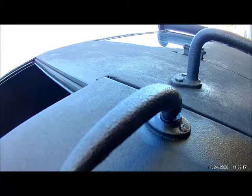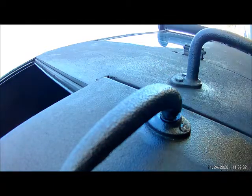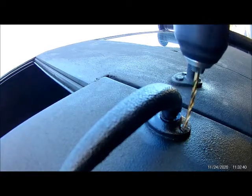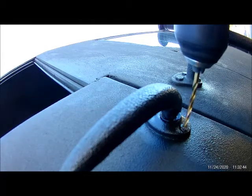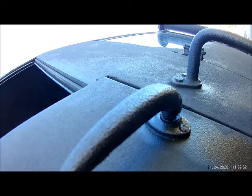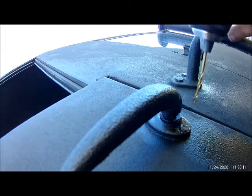All right, that's a nice clean hole. See if this stupid thing will catch now — I don't think it will, but I had to try. It might need a little bit deeper. While I've got this, it's going to make a nice pilot hole for the center. I'm going to punch all the way through the screw with a smaller drill bit, which should allow me to get it out if need be.